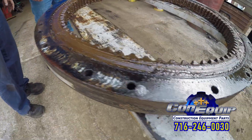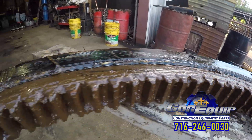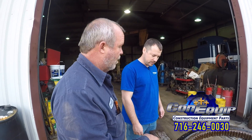Donald, what do you think happened to this one, or what did the customer experience? It's just years of grit and grime getting down through the center where the rotation manifold is — stuff getting down in it, water getting in there and rusting. None of the teeth are bad; it was just getting a lot of slack in the bearing. You could pick up on the bucket and feel it teeter-totter. He just wanted to fix it before it broke the teeth on the rotation — and it's more money for pinion shafts if you let it go further.